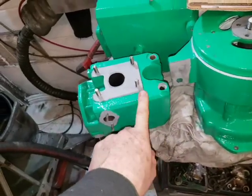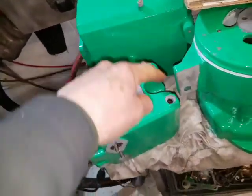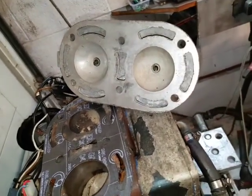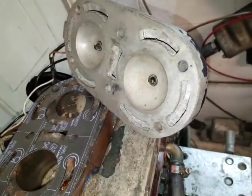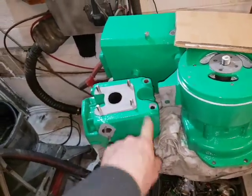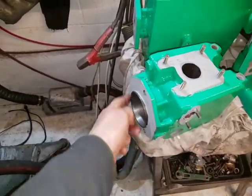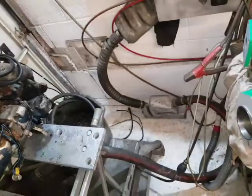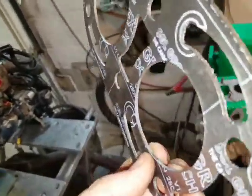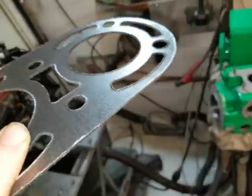No joint, no dissimilar metals, cannot fail. And this is surrounded by water, much more water, I think, than passes through the Dolphin. And on the failure rate, I've never had a failure of a cylinder head gasket. You don't need a cylinder head gasket. You just take the pot off, and there's a low pressure seal here, which is a special kind of paper, not this compromised gasket. And I say compromised because there's no high pressure seal where it needs it. Shame, really.